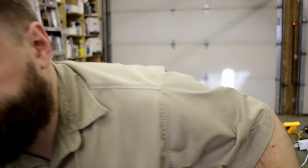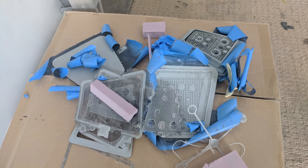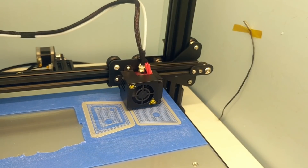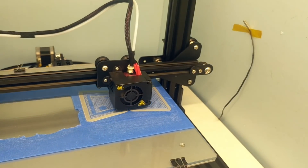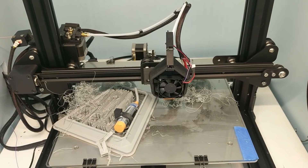Then I could finally get to printing them — but that's where everything went pear-shaped. Even though I'd been printing ASA without issues for weeks, those were all small parts that printed within half an hour to an hour. When I started printing larger parts they were taking 10, 30, or 50 hours to finish, and the filament would jam halfway through the night. It was really hard to diagnose because I couldn't sit there and watch it that long.